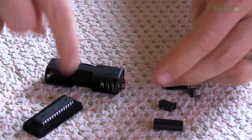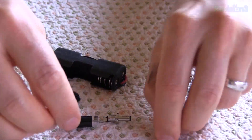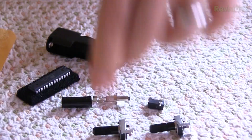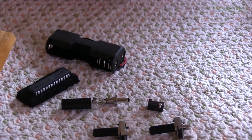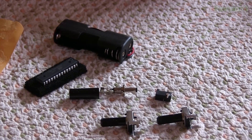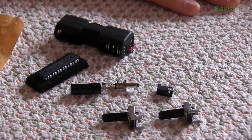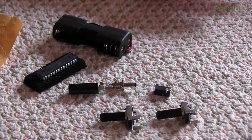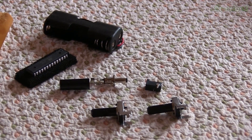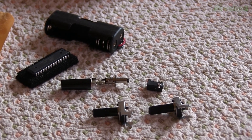The battery holder is wired up to this DC plug. And these are the variable resistors used to fine-tune the position of the meters. It's not how you set the time — it's more a matter of calibrating the analog meters, because they're only precise to about 2%. Temperature variations will actually cause the needles to deflect a little bit, so if they're outside they'll move around depending on weather. But in a house or an office, it's very stable.